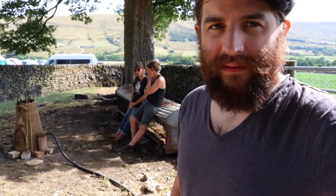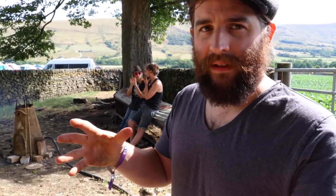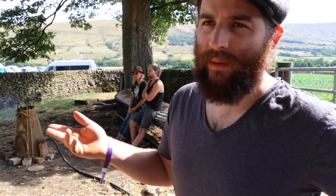Perfect. And from the last time you did this, is it correct you forged an axe out of the... Yeah, we got a good couple of kilos out of the last one, and took it back to my workshop in Leicestershire and forged it from a raw spongy bloom into a piece of bar, and then made up a traditional form of axe with the welded iron. Because we produced low carbon steel, I took some of it and carburized that more to produce a tougher edge steel, and finished it all up.